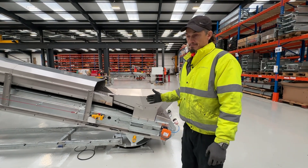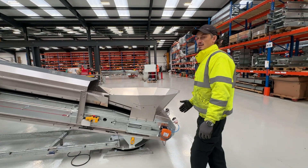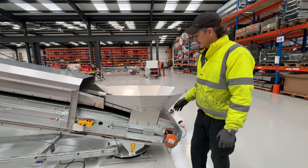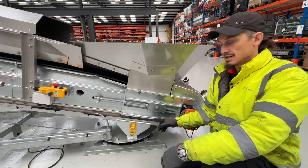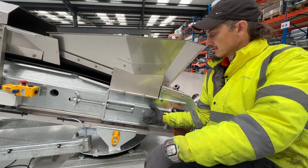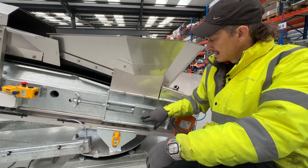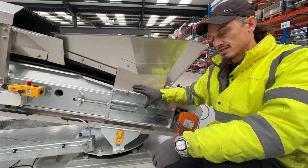If your belt is out of line and needs tracking to keep it nice and straight, to reduce wear and tear and keep the machine running correctly, we'll do the tracking with these stud bars here. Most important is this locking plate — it must be undone or loosened so the tracking procedure can be carried out. If this bolt is locked up tight, the tail won't move and you won't be able to track the tail of the conveyor.